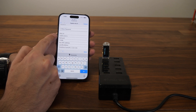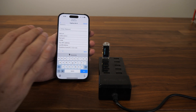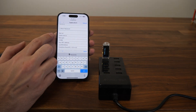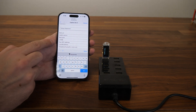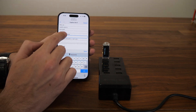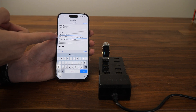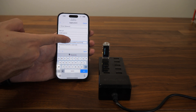Leave the pool URL and pool port at their default settings and use the public pool at publicpool.io. Most pools will not support this low hash rate miner — it has very, very low hash rate and most pools will just reject it. So leave it by default or use a pool that supports low hash rates. For the Bitcoin address, remove the existing one and paste in your own. This is where you'll get paid if you get lucky and hit a block, so make sure it's correct.